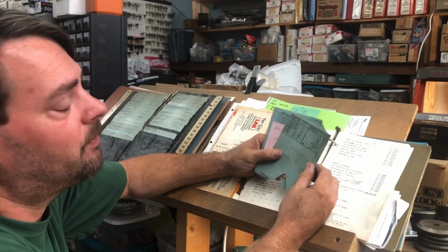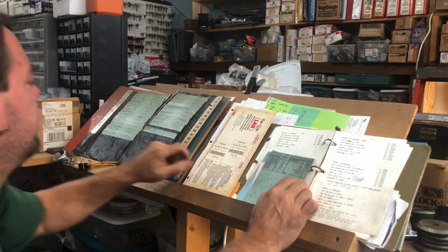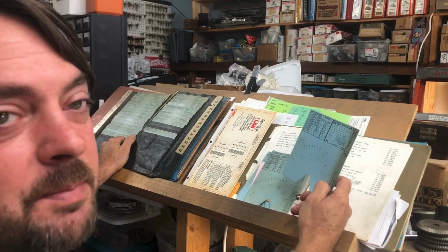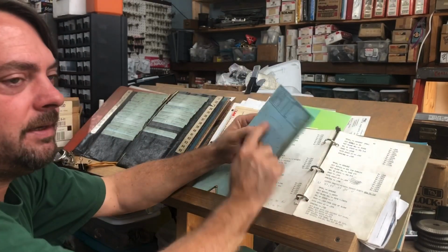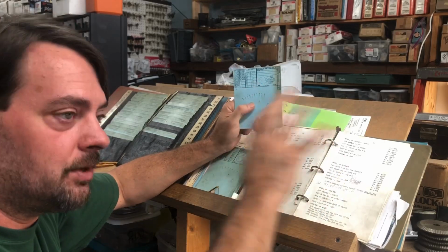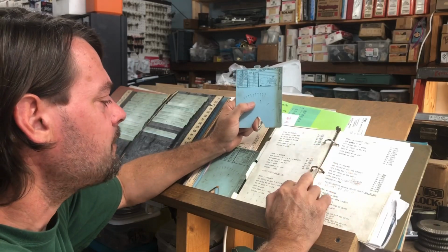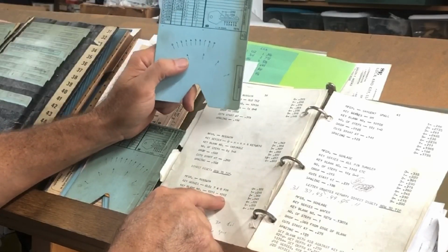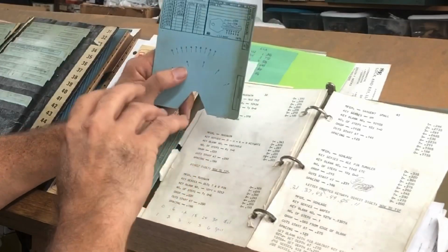If we wanted to be a little bit more exact than that, you could go in here. You got the Russwin large pin, and then you got Russwin large pin standard. And I believe it's one of those mystery things, I think. But if we look at the cuts here, and this would be, you know, the 1200, then we would go to the framing. If we wanted to get even more exact, if we're going to be using this in a business that has other keys or even a master key system, yes, you need to go as specific as you can. And we flip through, and there's several Russwin, and it even has a 10, 11, 10, 12, 7 steps, 156 standard spacing. So you could put this card in there.